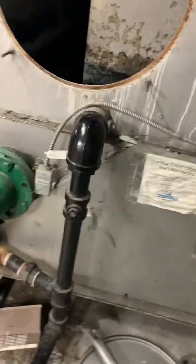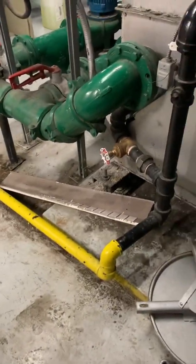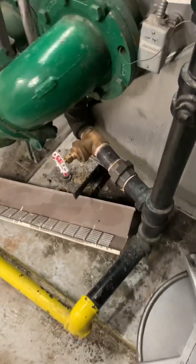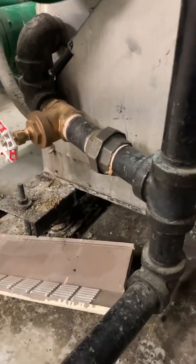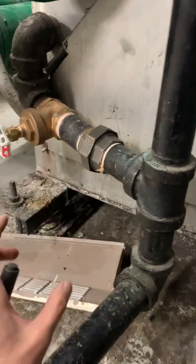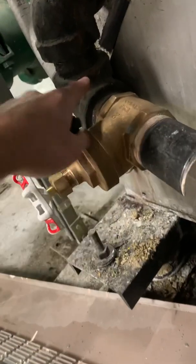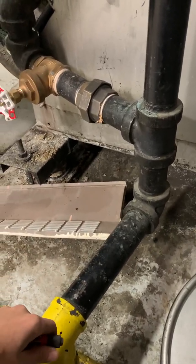The other problem I had — as I mentioned briefly — is when I wanted to drain this cooling tower to make sure it fills properly, I cranked open the drain valve and almost no water came out. So there's a problem that also needs to be addressed. Like anyone would do, I cracked the union to see if it was blocked with the valve closed. I found that whoever installed this union made it almost impossible to put back again. As soon as I undid the union, it dropped and twisted. This is a two-inch line, and once I opened it I could see clearly through, so the blockage would be farther up in the cooling tower. It took us probably an hour to get this union back on, and it's not even on properly — just temporarily.